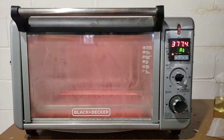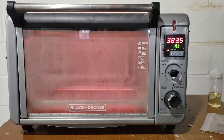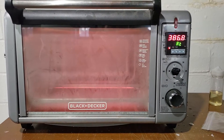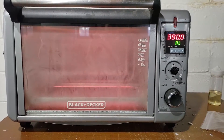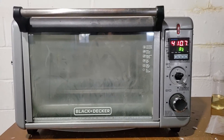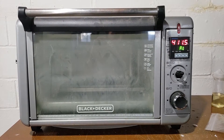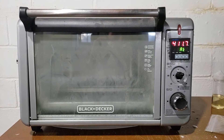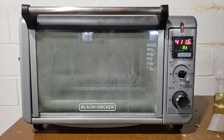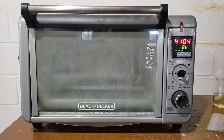Alright, we're approaching 390 — let's see what it does. This is on the auto-tune, so it's probably going to overshoot and measure how much it goes over. We're 21 degrees over our setpoint and still rising. I think it's going to drop back down below 390 quite a bit before it completes the auto-tune — it's measuring how much the temperature fluctuates when the output cycles on and off.